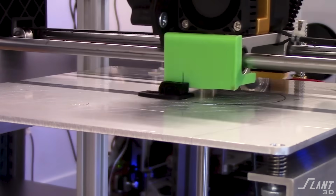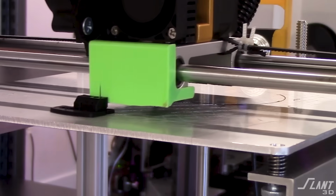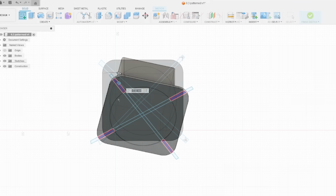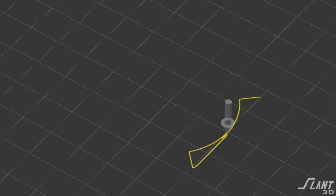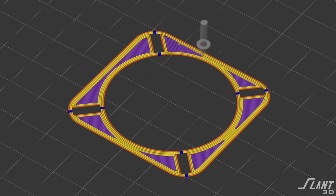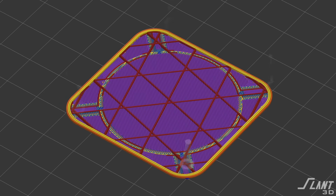This also improves mass production because auto ejection is more reliable and all that kind of thing. You can take this a step further because, again, that rastering, if you're working in these corners, you can have some corners with longer streaks of materials than ones on the other side where they're turned 90 degrees. You can also cut like an X through the raft, which will break up those continuous lines so that, again, you just have material sticking to the bed, but you don't have these long shrink regions that can cause issues on the raft and other pieces of material.